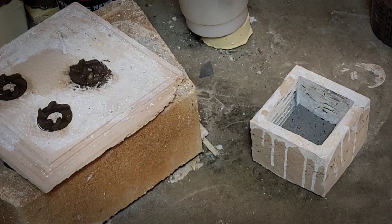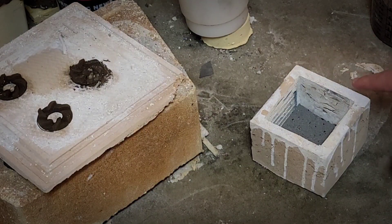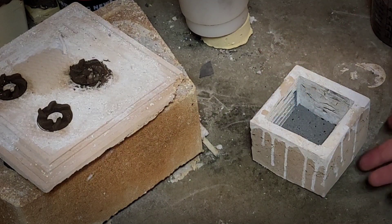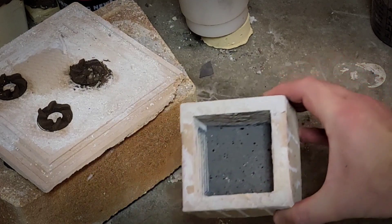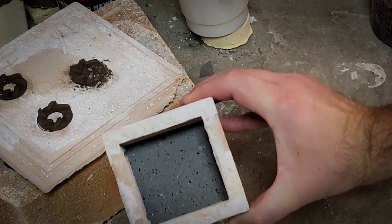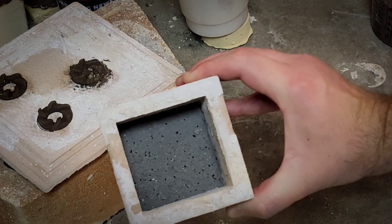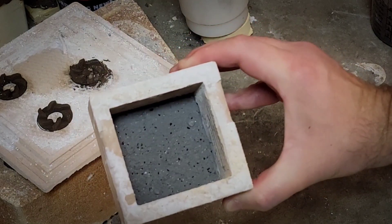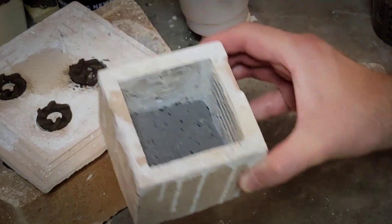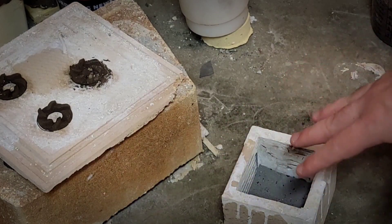Next we're going to do something very similar to any other metal sintering steps I've done before. This is our microwave kiln — the walls are lined with silicon carbide, printed with Virtual Foundry filament, and I cast this crucible. It's a little rough but I think it'll work. The graphite seemed to conduct very well, which is not surprising, and the ballast we'll be using for our impeller has a bit of graphite in it, so this will be quite interesting. We have elements on the walls, graphite ballast, and the actual piece will go right in here.